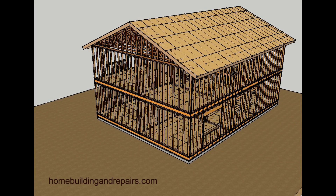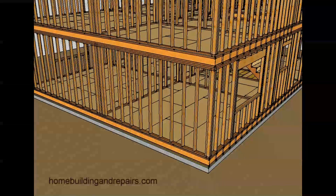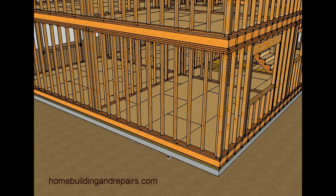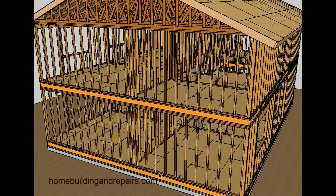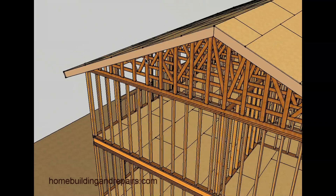Let's take a look at a two-story home and see if we can provide a little more clarity on this. The wall framing plates will connect to the floors, and the floors provide us with a nice solid structural plane. So we are not going to have any hinge points at the bottom or top plates here until we actually get up to the roof framing.